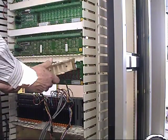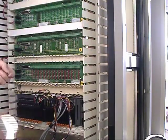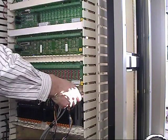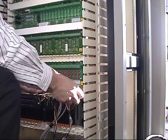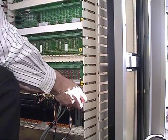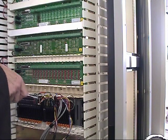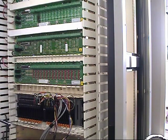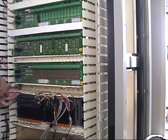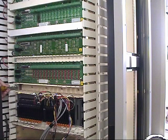Now we would take our inch-and-a-half cable tray — Provox was delivered with one-inch cable trays. The form factor here does allow us to put the inch-and-a-half cable tray in, which we feel is a good idea since we're accommodating a maximum of 24 pairs per horizontal row versus 16 on Provox. This cable tray is a standard Provox issue still available as part of the Charms migration, and it recesses between the rails to provide more capacity for the 24 pairs accommodated by a Charms rack.